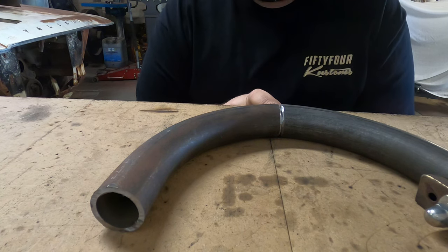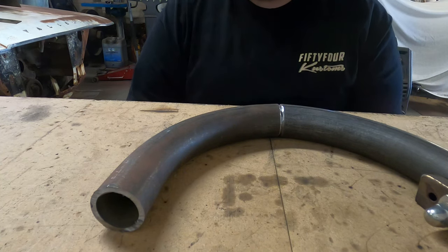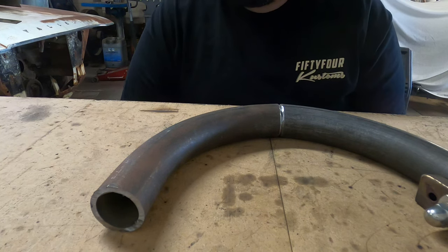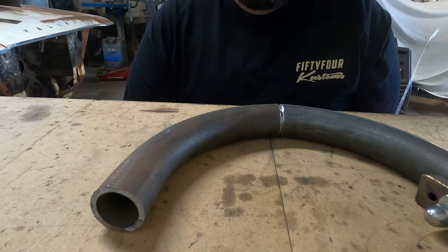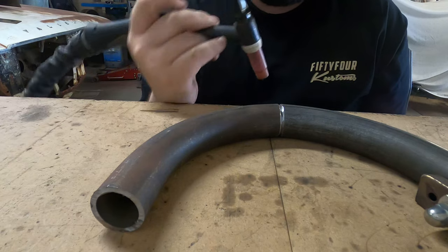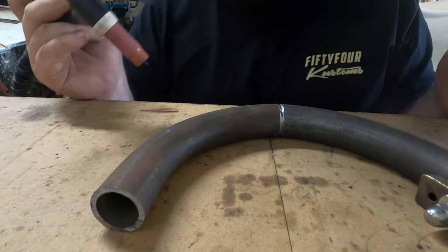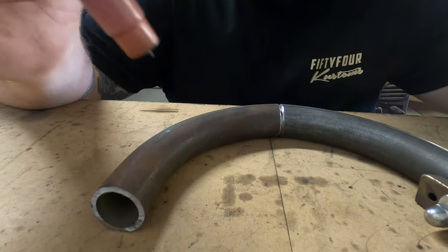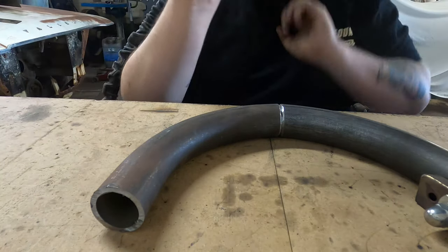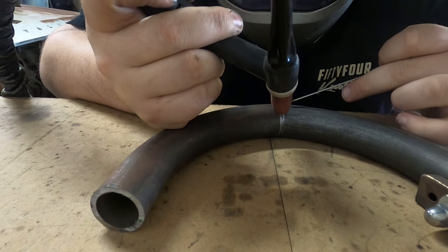Alrighty, so this is our tail shaft loop. We've just taken 30mm out of both, so just pulling together 60mm, to suit that tunnel that we're going to roll a little bit better. So just put a little bit of V prep on there. Not too much, it doesn't need shitloads. Then tack it together. So what I'll do is just tack it, roll it over, tack the other side. Then I'll weld it. It's like 2.3 mil wall, and we're at 110 amp, which should be more than sufficient. Turn that on.